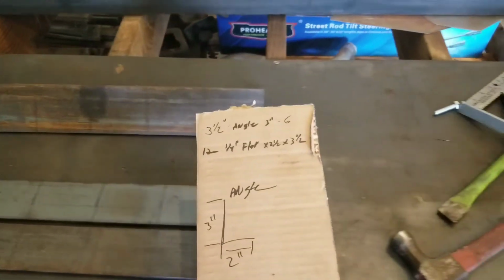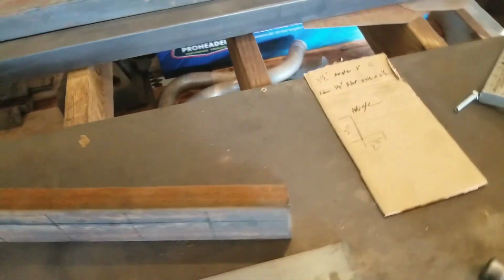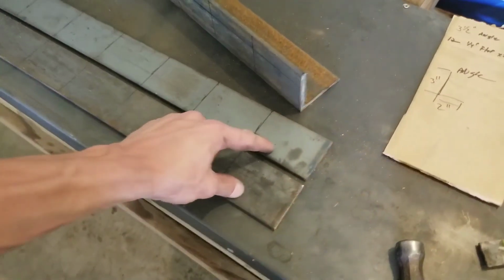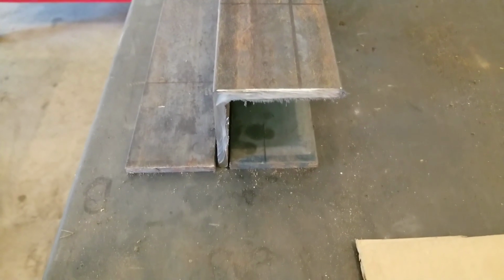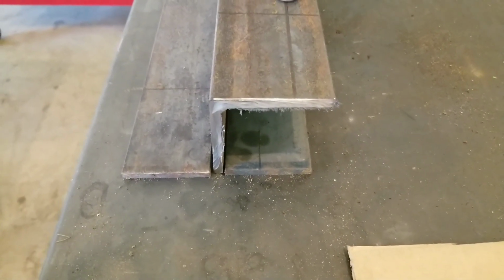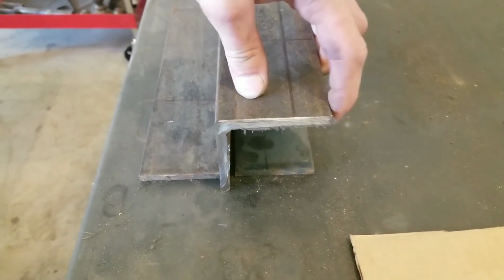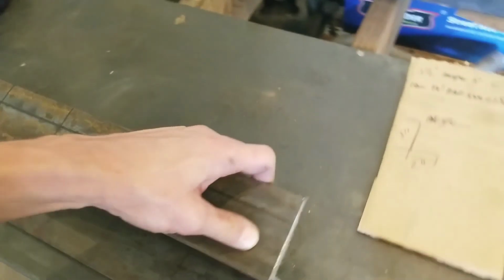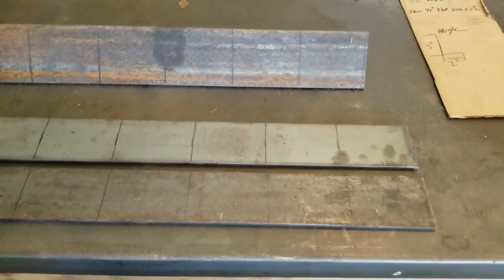So essentially what I've determined is I'm going to run an angle bracket off of the fence posts and then weld flat steel to it like this. So the 2 pieces of flat will be through bolted to the fence post, and then the 1.5 inch square tubing gets welded up here, and essentially I will make a slide channel for the gate. And again, as I continue building, I think it will make sense to you as to what I'm trying to do.